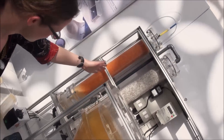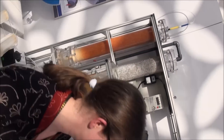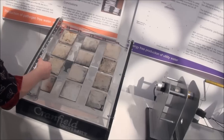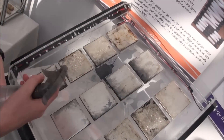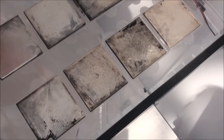Condensing the vapor is the role of these columns. The columns have hydrophobic and hydrophilic beads in them, and you can see that on this demonstrator here. The hydrophilic coating allows the water to run off, and the hydrophobic coating causes the water to bead up, which allows it to drain really easily.